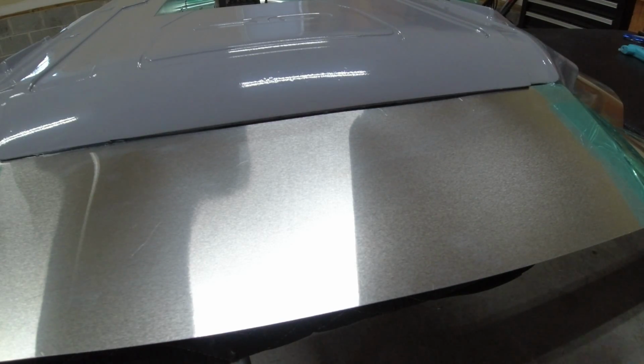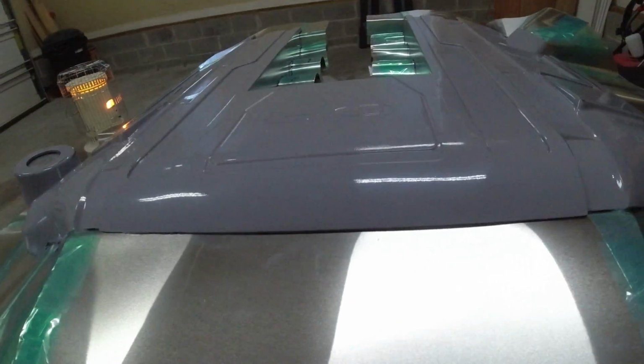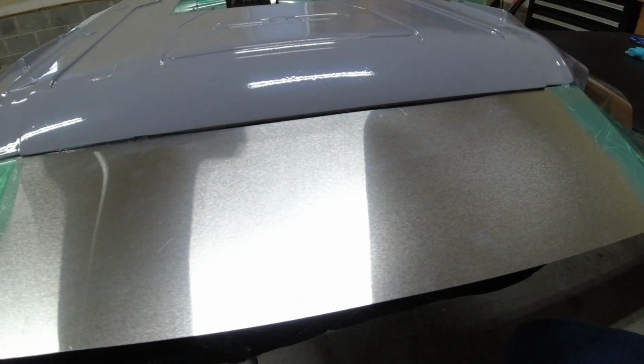And now for our next step, we just need to refine where our flange material meets the plug. So I'm going to pick up the camera. Right there in this little area, you can see where there's a little bit of an air gap. That needs to be addressed, because if not, the gel coat will create a mechanical fastening.